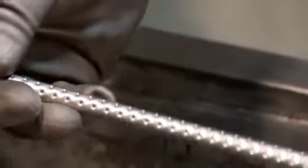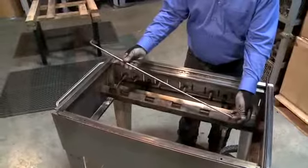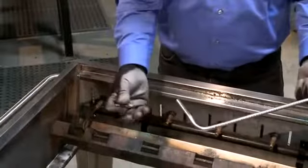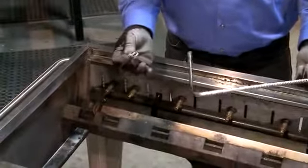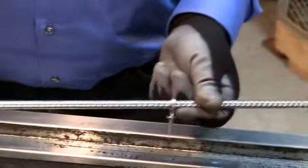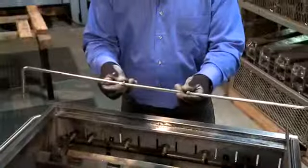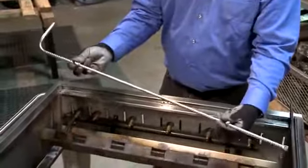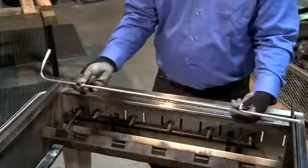Here's a brand new pilot tube — all nice and clean. The ports are wide open, no carbon. It'll come with brand new eye bolts, and this is what holds the pilot tubes in place. They install by sliding them over the inlet end of the tube, two per tube, with a single nut threaded all the way down. There will always be two for each pilot tube, regardless of size — left, right, it doesn't matter.